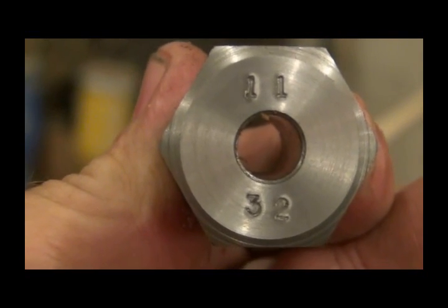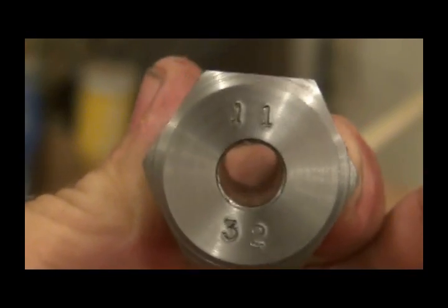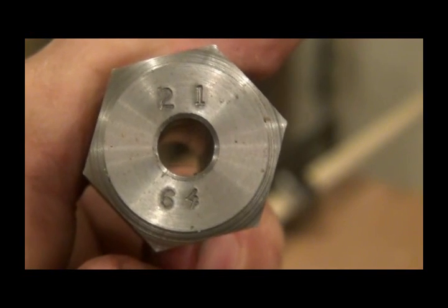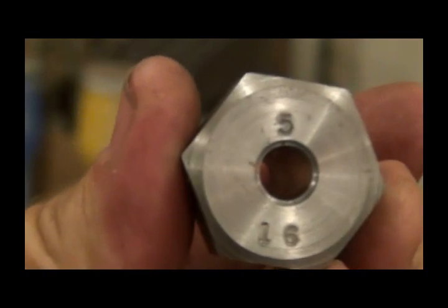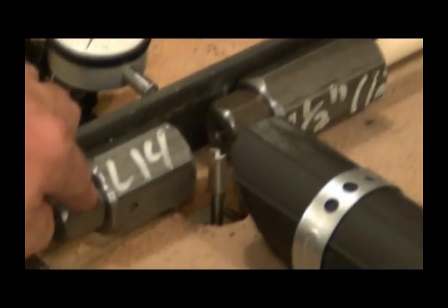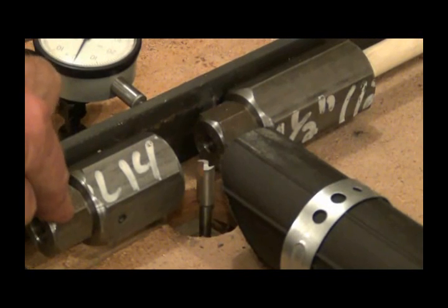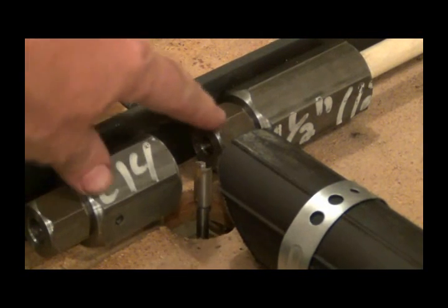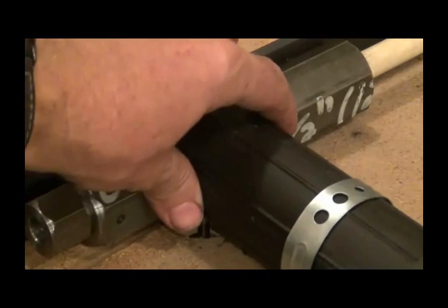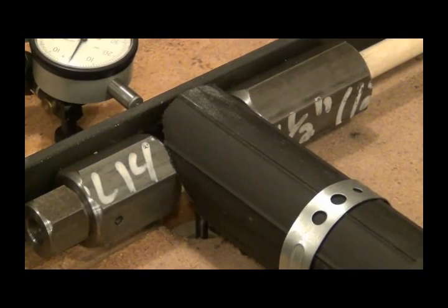I stamped 11/32 because that's the diameter of that hole — I drilled it, reamed it, and chamfered the hole. Right here is 21/64ths, 5/16ths. The ones that I've already got inserted: this is the half inch that will accept the 3/8ths square. And this one over here is 23/64ths. I have put a shop vac attachment that I can scoot right in there and hook a shop vac on the other end of it to try to eliminate a lot of the chips that are going to be flying from this operation.